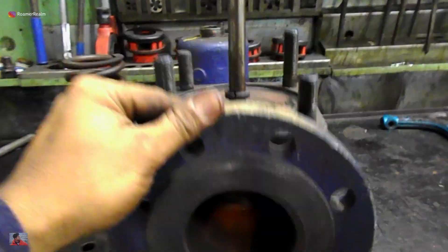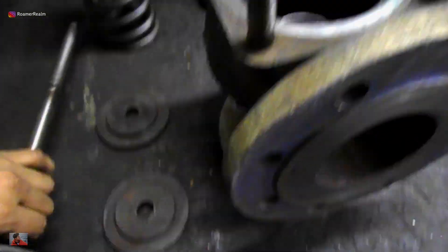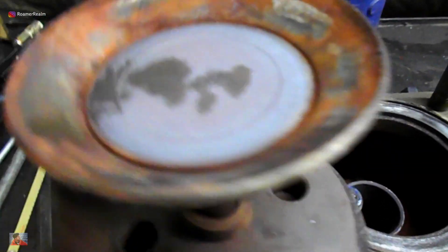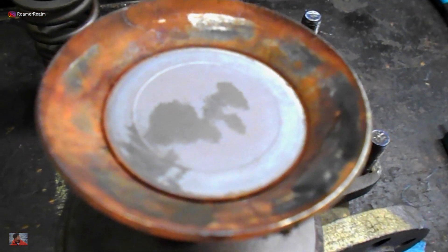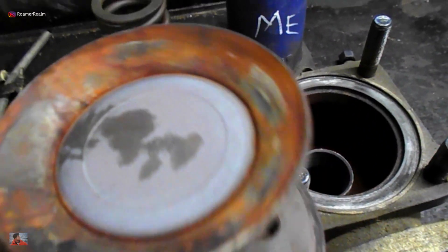The ship is around 10 years old and despite a thorough surface cleaning, the parts will never look like new. The boiler water treatment, operating parameters and chemicals involved lead to a chemical reaction with the valve material, which is also a contributory cause. Discolouration is not a big deal, but pay special attention that there are no pitting or corrosion marks on the mating surfaces.